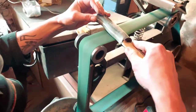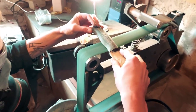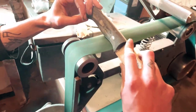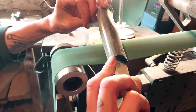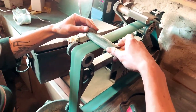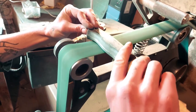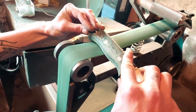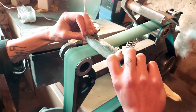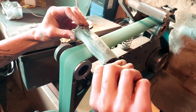We were just saying that the belts on this particular one lend themselves to handle making really well, because they've actually got a bit of give and a bit of play, as you can see there, with the handle being shaped there. The belt almost has a bit of bounce in it, and what that does is it enables Josh to actually feel and fine tune any high profiles and platforms, and just iron out any of those lines so that it's super smooth.